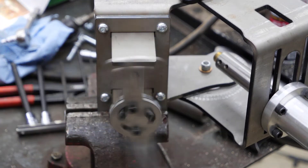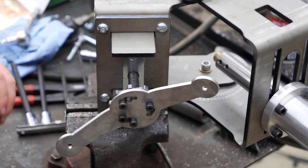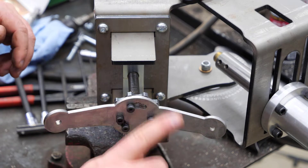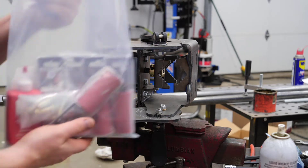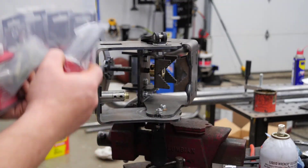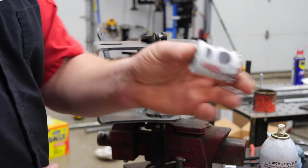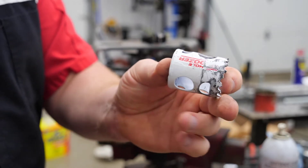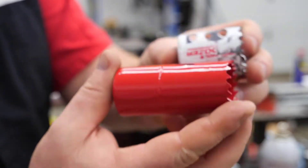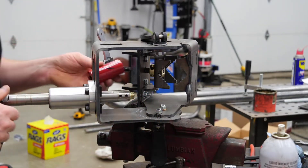I'm going to put a little bit of grease in here, grease my bearings, and I'll be ready for my first notch. I got the pro kit, which means I get the really deep hole saws. Here's a comparison: this is the normal hole saw from your local hardware store, and that is the new hole saw from Rogue Fabrication — you can actually see the line where it is extended. You get pretty much double the length with the extra deep option, and it goes right on the arbor we put in.